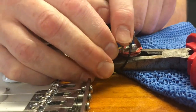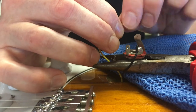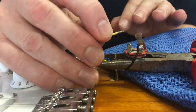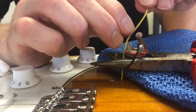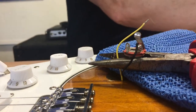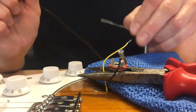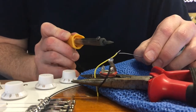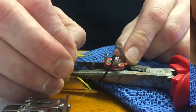So that's how we're going to do it. Another way to do it is to apply a little bit of solder to the wire first - or tin it. The trick to soldering is the old saying: you don't heat the solder, you heat the work. In this case the work is this piece of wire. You want to heat that wire up with the iron on one side and the solder on the other, let it melt, and it will flow over. And there we go - wire tinned.